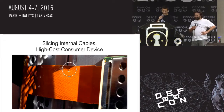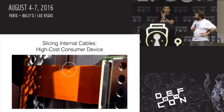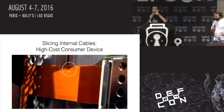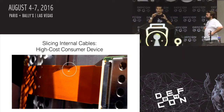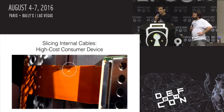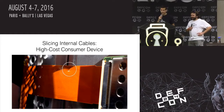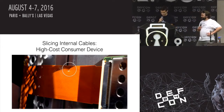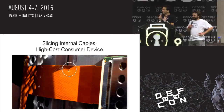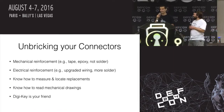And if you look on that circle, this is a flat flex cable. So it's a flexible circuit board where normally you might have one or two layers on a flexible board. This is a multi-layer flex board connecting very expensive pieces of equipment together that I accidentally tore. And tried to fix it. I was like, oh, some wires, right? Like if you can solder the top and bottom. But they were multi-layer, and it was horrendously embarrassing and never to be spoken of again, now that it's on film. You just returned it, right? Actually, we just returned it.